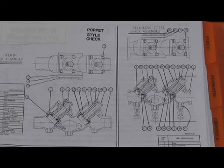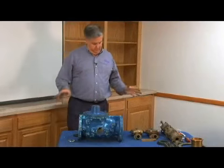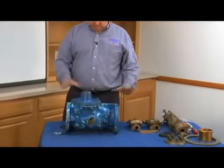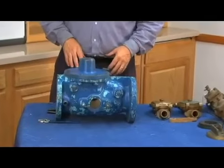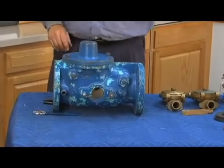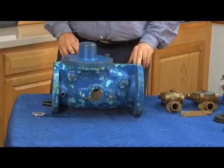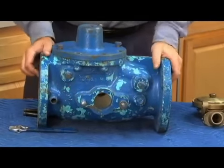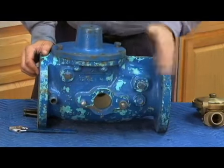So let's take a look at the 308-1 check, the 308-4 check, and the 3 relief valves, the CDHS-14, CDHS-20, and CDHS-24. Okay, in the Clayval world, talk about the individual check assemblies, the 308-1 and 308-4. I've got one check body here. This happens to be a 308-1 style, but I'm going to show you the differences in the 308-4 as we go through it. First, you'll notice that this has the mounting on the side. This was the first check of a Model RP1.